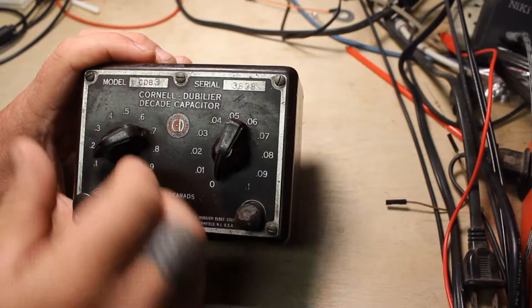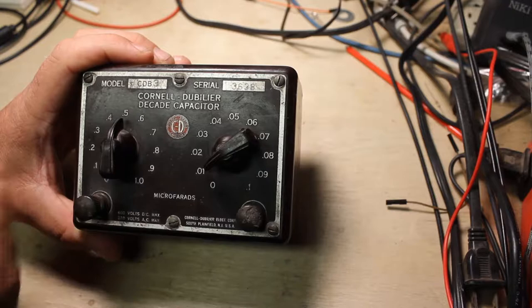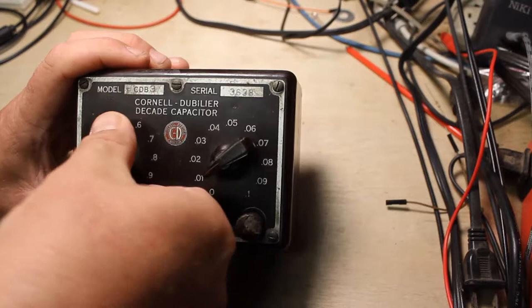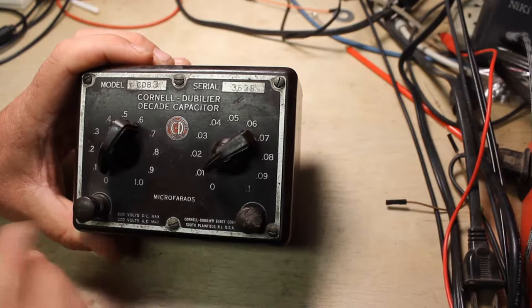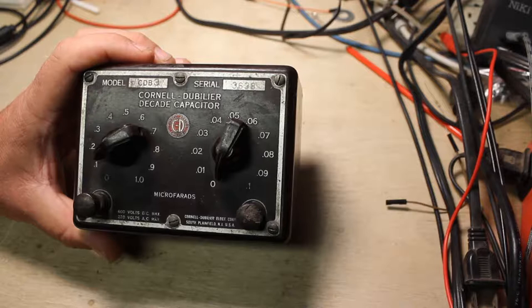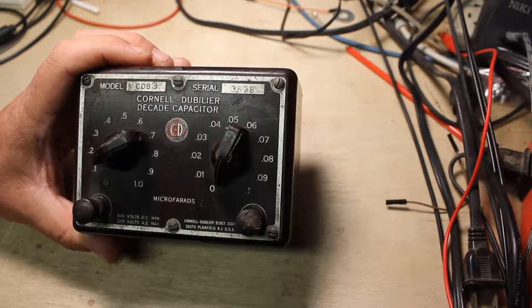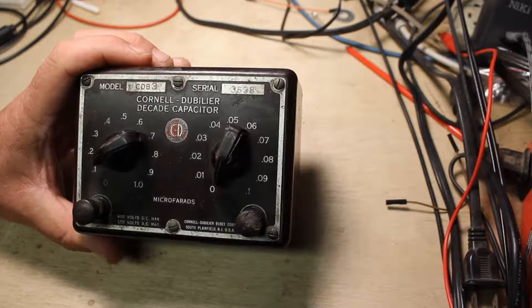These values actually all add together too. If I put this on 0.5 and then move this one up to 0.01, these two will add together and come out here. So if I just want this side, I need to bring this one back down to zero, otherwise it will be in parallel and change your capacitance. If you've got a 0.1 microfarad in circuit and you don't want to make a big jump, you could parallel a 0.01 across it — or maybe a 0.02.